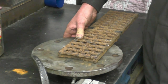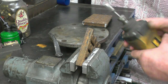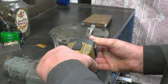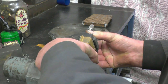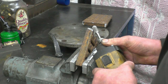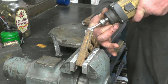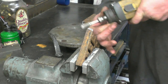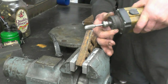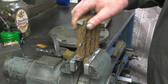The first thing to do is to veed it out and get some of the rust off it. I'll just use a carbide burr to remove some of it, and get good deep penetration into it.